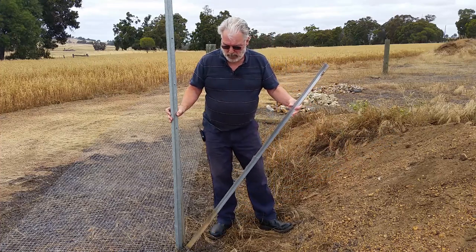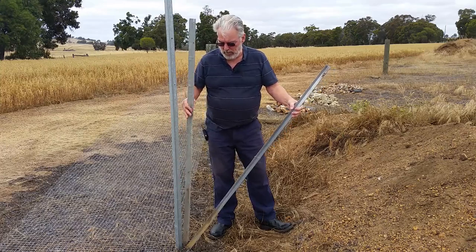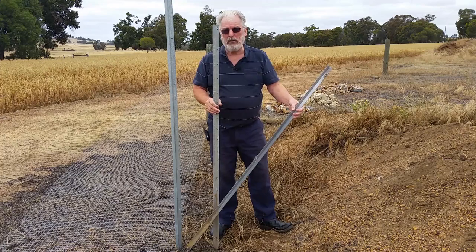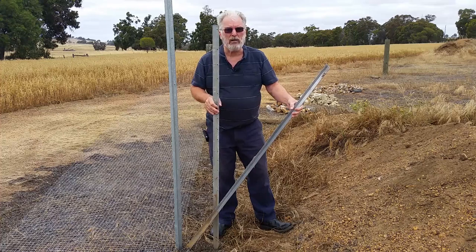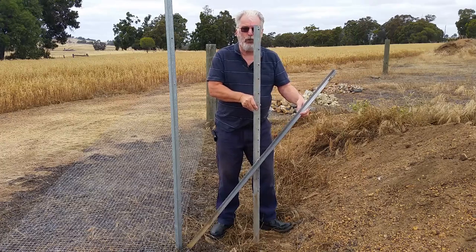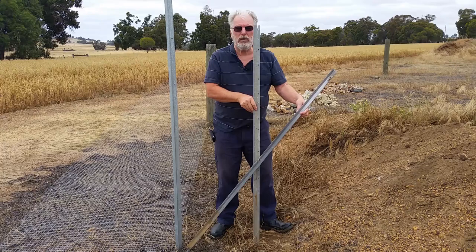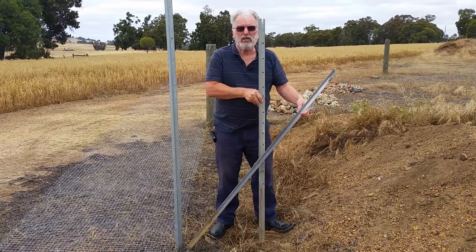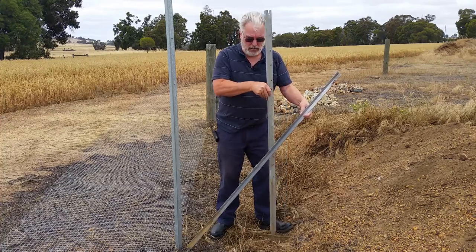Okay, so let's go back to our dry sandy soil. If we add some thickness to the wall, the weight of the wall increases the support and also reduces this triangle of dead weight that's pushing against the wall. And if you come out 2 foot for a 4 foot wall, you've got four times the weight in the wall than you've got in the actual triangle of sand. So as you increase the thickness of the wall, you're reducing the weight that's going against it.